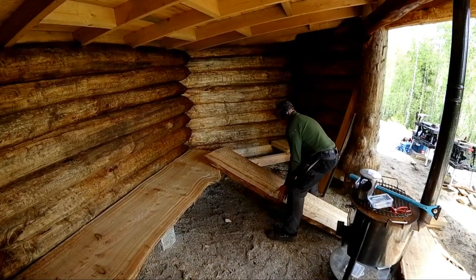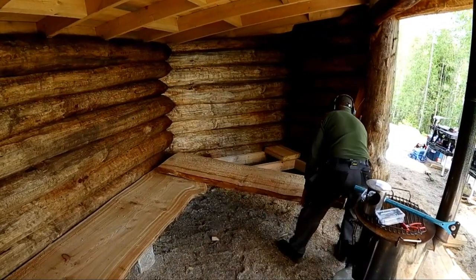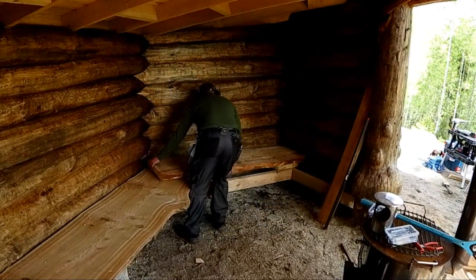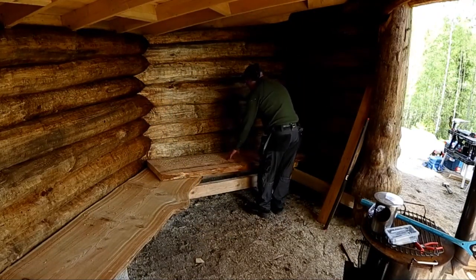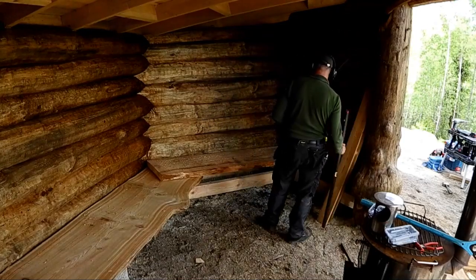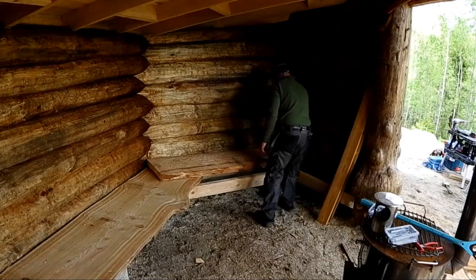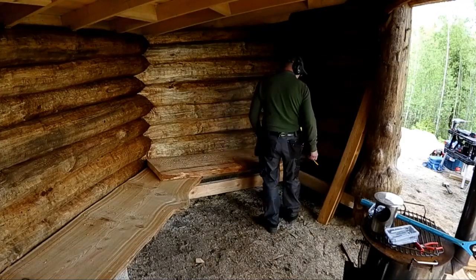Okay, not so sure I explained that terribly well, but here's how it works. Because of the two-cut rule, I cut this plank a little bit too long, same place, and got it lined up. And then the right end of this plank didn't quite match the angle of the wall to the right there, so those couple of extra centimeters that I left means that I'm then able to easily just draw the new angle and adjust the end of the plank.